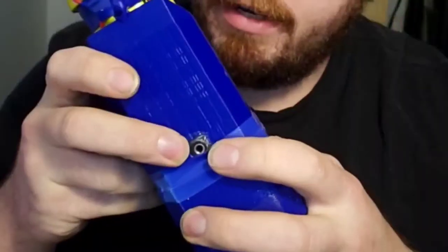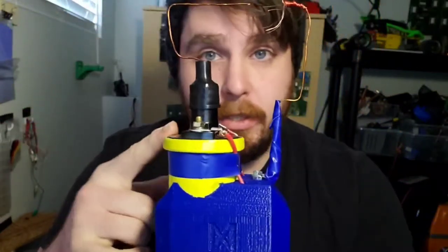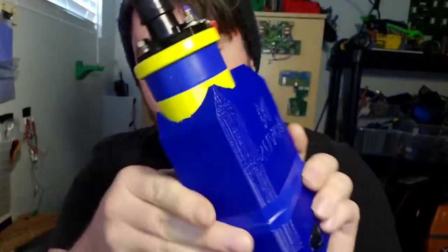So what is this thing? All that audio that you just heard is actually coming from that high voltage arc, and yes, that is connected to my guitar right through this auxiliary jack right here. This is my high voltage music player. This thing right here is actually just a big ignition coil from a car, and inside this box that I designed and 3D printed is all the circuitry required to make this ignition coil play music that's inputted over that auxiliary jack.